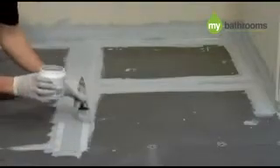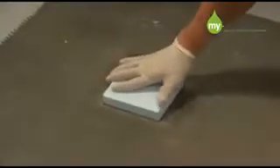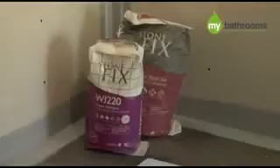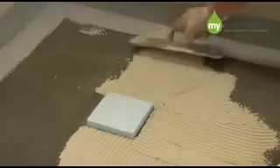It is also very important for the guarantee of the product. Place the disposable tiling aid into the drain. Using a suitable, flexible tiling adhesive, begin tiling. For tiling these shower bases, we recommend the use of an S1 cement based tile adhesive with flexible additives such as StoneFix, which will give you a very high adhesion grip and a good degree of flexibility.